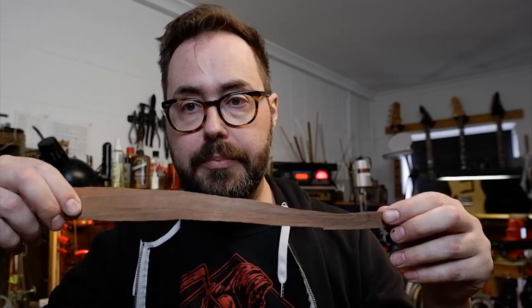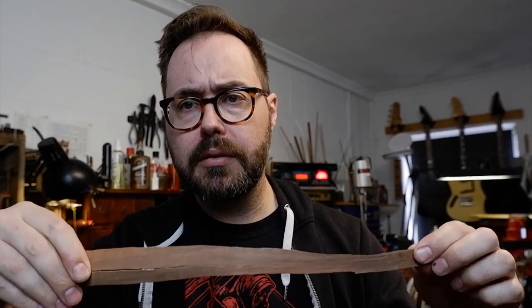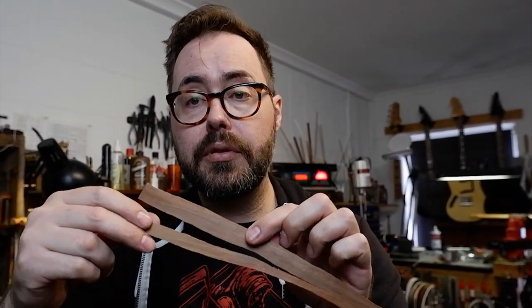It's a wood thing. And it is a wood thing. This is my crappy example for the week — it's a piece of veneer. Look, it's really flexible this way, and then this way it's really quite stiff. It's like your neck. If you get along the grain line, just super easy to snap. It's like when you cut firewood, right? It's snapped along the grain line. You don't cut firewood like that — you lean it up and it just cleaves apart. And that's exactly what's happening to your headstock.